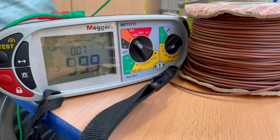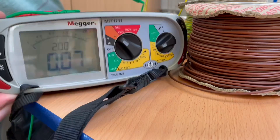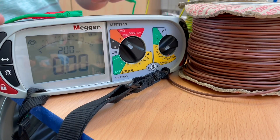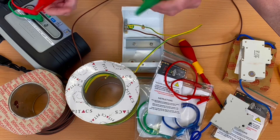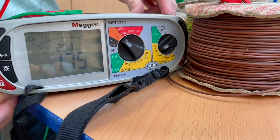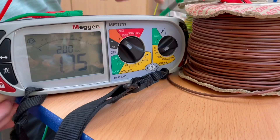Setup wise, first of all we're going to need to remove the resistance of our leads. That's sitting at zero — it's not flashing, and remember if it's flashing it's gone below zero. I've got them linked together in the consumer unit. I walk out into my installation and I'm going to test between my CPC and my line connection, and I've got a reading of 1.75 ohms.